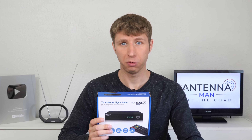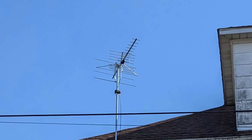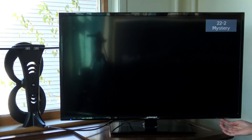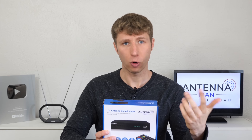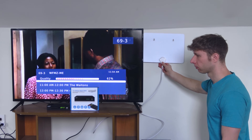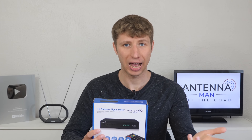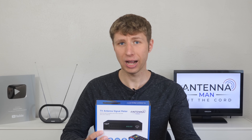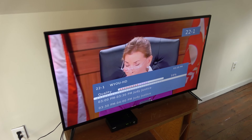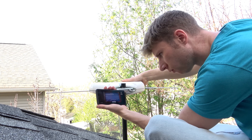As you can see in this video, the key to the best reception and most channels possible with your antenna is with the help of a signal meter. It's very unlikely that the convenient spot you placed your antenna — near the TV, outside, or in the attic — is optimal for the best reception of all local channels. Using my signal meter as a guide will help you adjust your antenna, gain more channels, or at the very least increase the signal strength of existing channels so they are picked up more reliably. I understand it might be a bit of a task if you have an attic or outdoor antenna since it has to be directly connected to a TV, but you have options: connect it to a small TV with an extension cord, or set up a video call with a laptop or smartphone pointing towards a TV to use as a guide while you adjust your antenna in a different location.